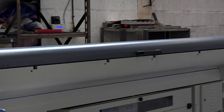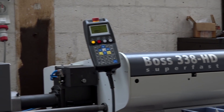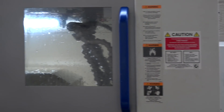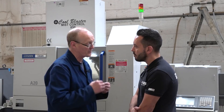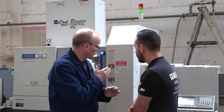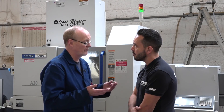Is this because you've got the three metre bar feeder? Yes, a bigger bar feeder. We also found that tooling costs have come down astronomically — we've got a hundred percent saving on tooling costs as well, which has helped. That's due to the fact we're using neat cutting oil whereas we used soluble oil before; it's far superior.